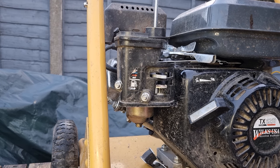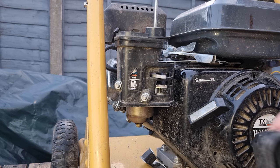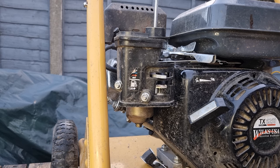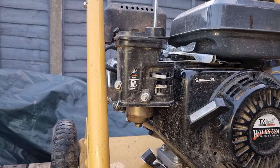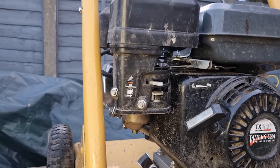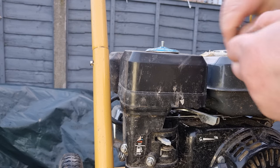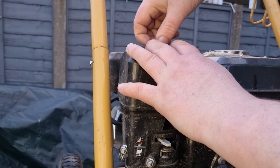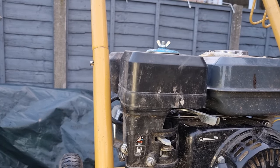So now we want to replace the air filter, and this can be a good time just to check your air filter. That's what's inside your air filter — let's take mine out. Yep, that looks fine. Obviously if it's gunked up you could either try and clean it up or replace it completely. You just want to pop that back on there, pop the bit on, make sure it's popped in, then screw the wing nut back down. And there you have it — that's the machine put back together.